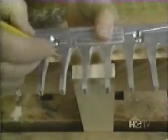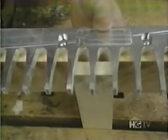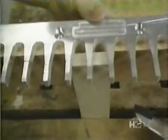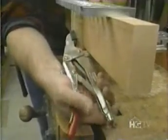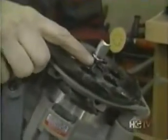Now with an additional fixture, which is meant for cutting the pins, I align the edge of the finger to just cover the pencil line and clamp it in place. The router bit that I'm going to use to cut the pins also has a ball bearing at the top, but it's a straight cutting bit instead of a dovetailing bit.